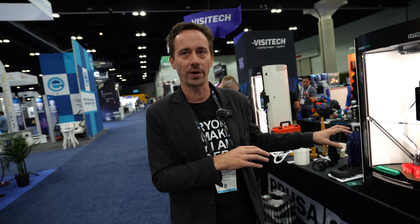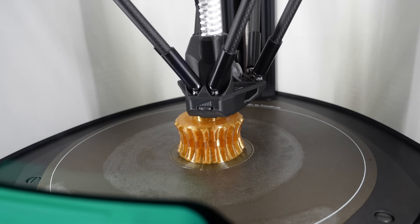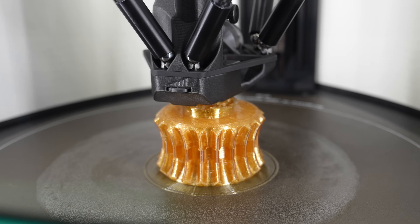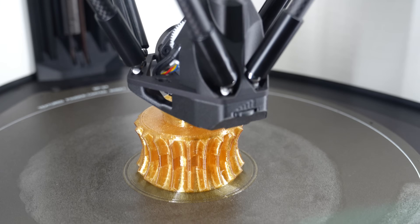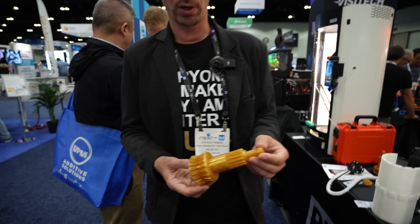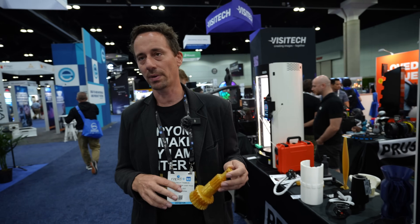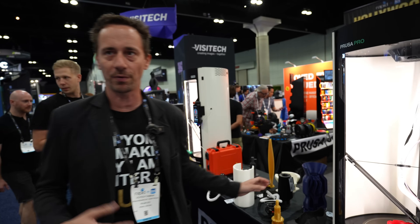We've been talking about the high-flow printhead currently installed, which is printing ASA. But we didn't stop there — you can also connect a high-temperature printhead to the HT90. With the high-temperature printhead you can melt everything up to 500°C. That's your printhead for plastics like Ultem, PEEK, and polysulfones. With these polymers you get ultimate performance in every direction: mechanics-wise, temperature-wise, and chemical resistance. To give you an idea, pure PEI or Ultem can operate at almost up to 200°C, has awesome mechanical resistance, and very few solvents can dissolve it. We call these high-performance polymers.